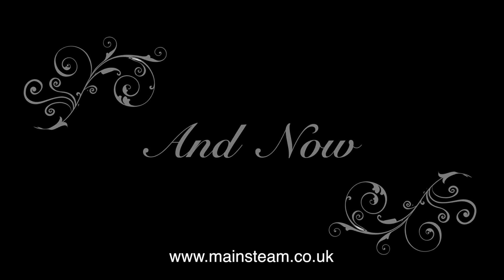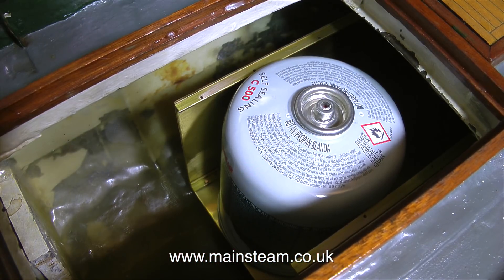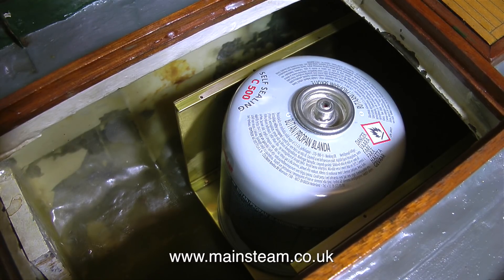Now the good bit: I'm going to mount the gas canister inside the water tank. In a previous video I showed how I steamed my 5-inch gauge locomotive using a gas burner with one of these gas tanks. To my surprise it steamed very well indeed, but only when I put the gas canister in a tub of water. With the canister just sitting on the bench, it quickly chilled, pressure dropped, and the engine didn't raise steam. This pressure drop and resultant loss of heat is a universal problem with gas-fired boilers using butane-propane mixed canisters.